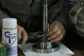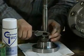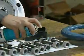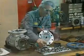Once all the necessary maintenance has been performed on a valve, the valve must be reassembled so that it can be returned to service. In this part, we'll see how a mechanic reassembles a flanged globe valve. The mechanic in our example begins the reassembly procedure by removing shims that were placed around the stem during a spotting in procedure. Next, he lubricates all moving and threaded valve parts.